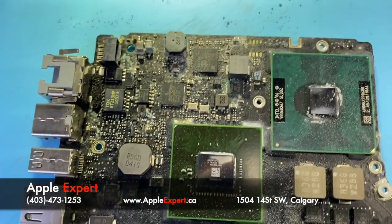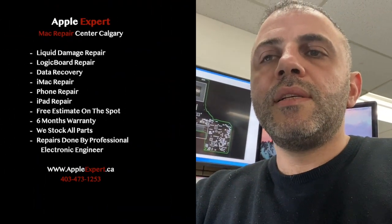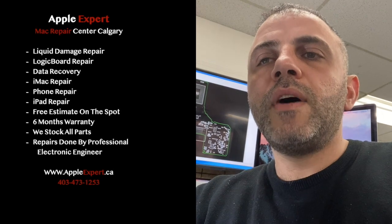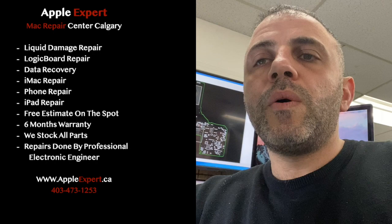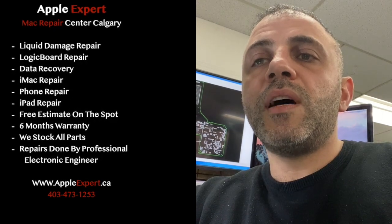We'll try to fix this logic board. The way I will deal with this logic board, since it's severe liquid damage, I'll remove as much as possible from the corroded chips, then retin all the corroded pads, then put the new chips after checking for short circuit to ground.